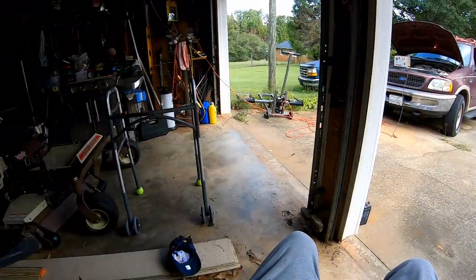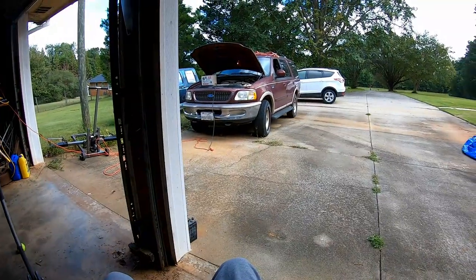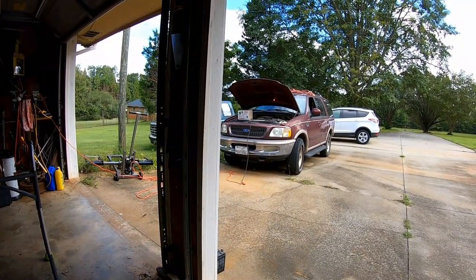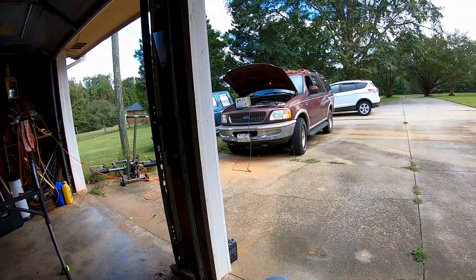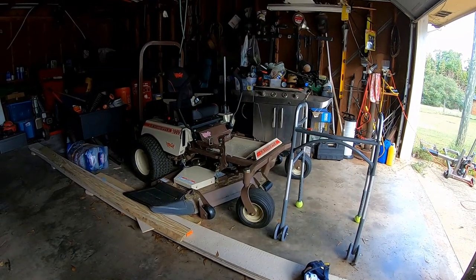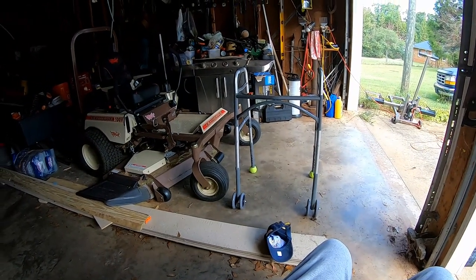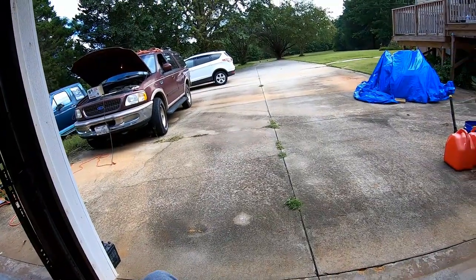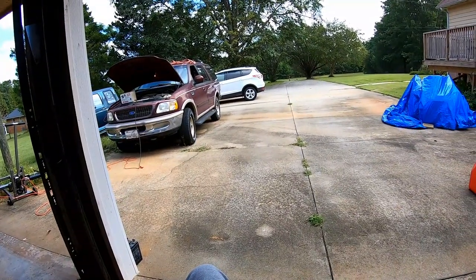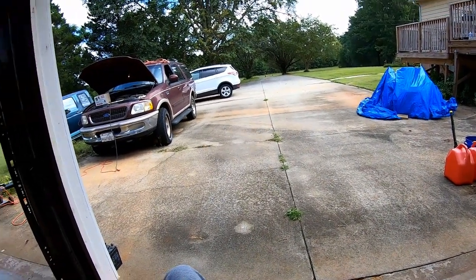All right, I'm back over here at the garage. I parked the walker and got in a roll around office chair. We're gonna scoot over here to the toolboxes. Well, I got a light on under the hood now that I got the charger hooked up. We're not even going to try until that battery takes a little bit of a charge. I need to get in here and sort out all my trailers and power tools and wood chippers and generators where I'd have more room to park both of my zero-turn mowers up in here. I pretty well figured out that my Husqvarna probably has a fuel solenoid problem. If it ain't that, it's going to be the carburetor, because I've already changed the fuel pump. That didn't do it.